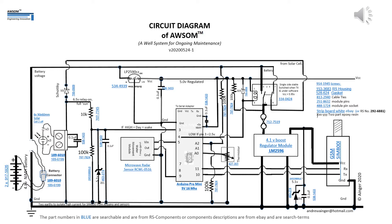The SIM800 unit takes a couple of amps for several hundred milliseconds just after it has been turned on, and then it settles down to a manageable 100 or so milliamps thereafter. Everything else draws relatively small amounts of power, but let's go through it piece by piece.